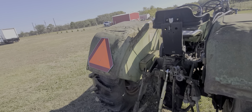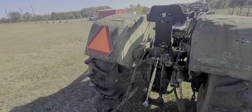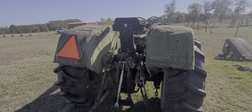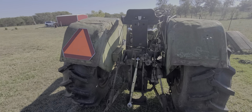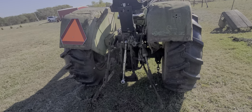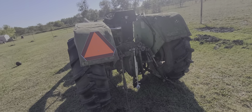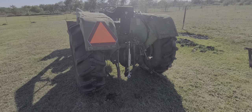The transmission mostly suffered. It's actually working incredibly well, the transmission. But there is wear on the side of the gears, which is actually fixable, but that wear is mostly due to not carefully shifting around the gears. Otherwise, there is still a lot of life in this transmission left. Just shift carefully and that's it. There is still so much gear left to engage. And they're not popping out when you load the tractor. They're not popping out at all. They're holding very strong, the gears.